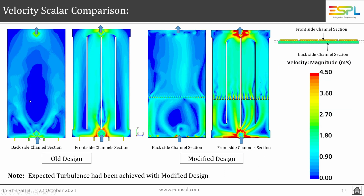In this design, on the visible side, there was about 30% area which didn't have any airflow in the first simulation. If you look at the current version, it has got much better. I would estimate now there's 15 to 20% where there is almost no airflow, so it's 10 to 15% better at the moment. But after the baffle plate, you can see it's much better. If a little bit more air would go here, close to the 60%, this would be almost uniform color also, and same goes here. So the baffle plates solve the problems like it's estimated.